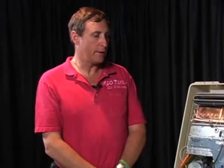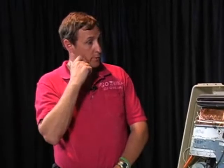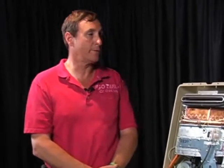Absolutely. And what's going to happen with most tankless water heaters is that when that maximum flow rate that's available because of the size of unit we have is exceeded, the flow will drop in all of those fixtures. So for example, we have 2 showers going, which typically is the maximum flow available from a tankless water heater here in Colorado at the altitude where we are, as well as the cold incoming water temperature that we have. Here in Colorado, our water is coming in at 40 degrees in the wintertime and 50 degrees in the summer. So that's another thing that an inspector can measure.